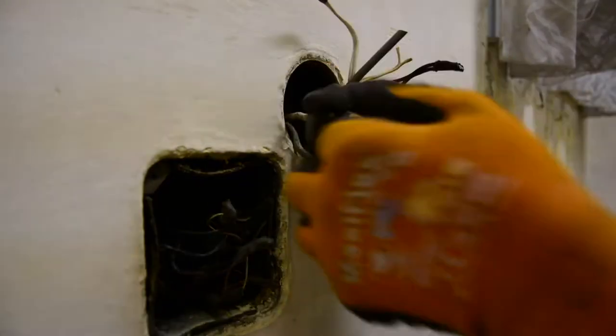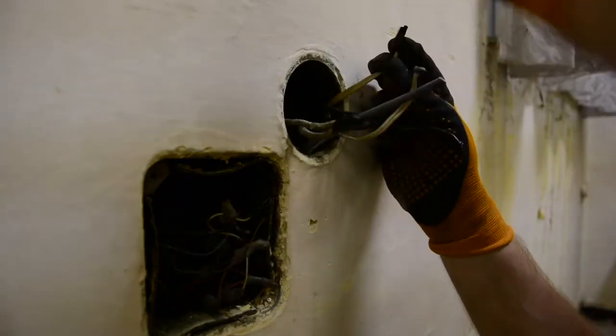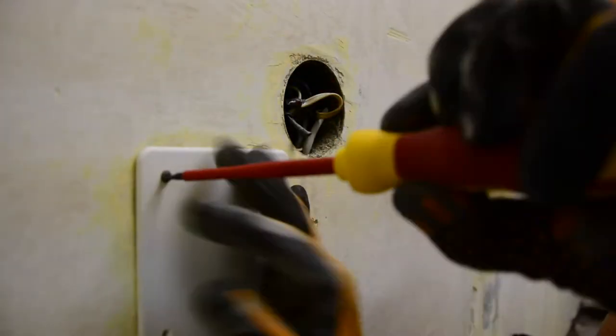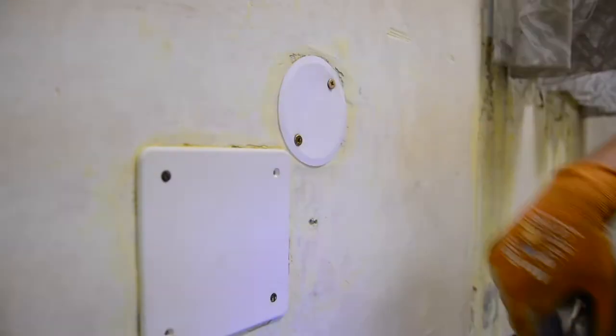The electricity is in very bad condition. Those are aluminum wires coated in cloth dipped in a tar of sort. This was typical electrical wiring in Czechoslovakian houses 50 years ago. The wires are still alive, but I don't dare to use them, so I'm just disconnecting and isolating everything.